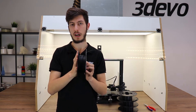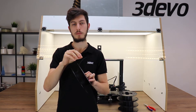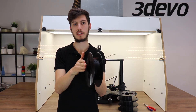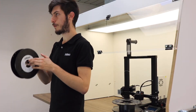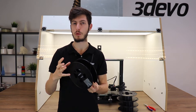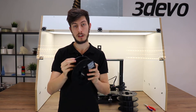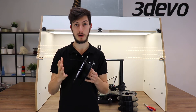The core aspect is the tolerance of the filament — that means the deviation of the thickness. A tight tolerance means the filament is consistent in thickness, which ensures a very even and good flow during the printing step. It is good to have a tool that can measure or assess the tolerance during extrusion. In our case, we made sure it is well kept within the industry standard of 50 microns.